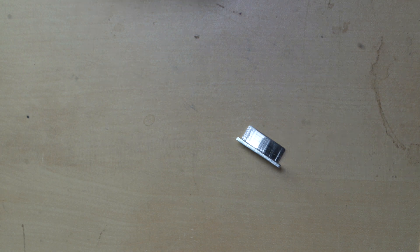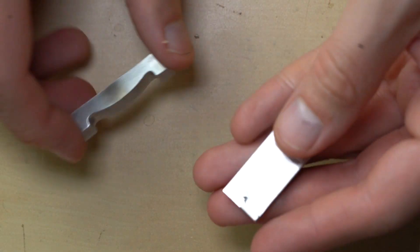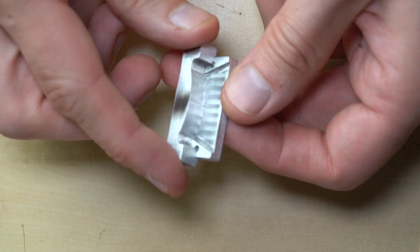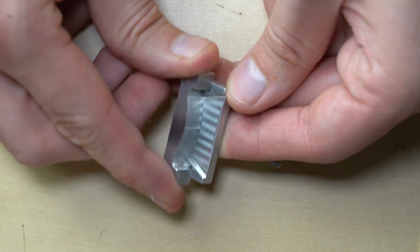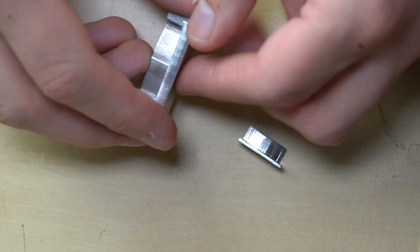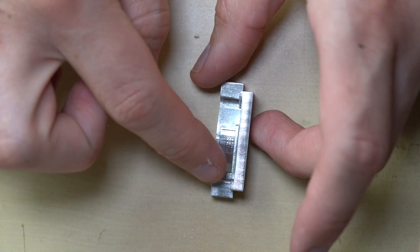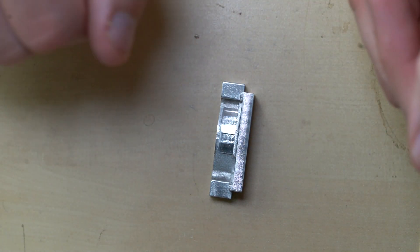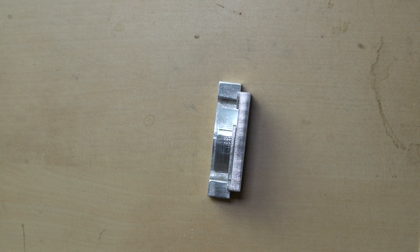Then we have our other holder that comes in two parts, with a really nice machining pattern. The real beauty of this part is just how well they go together - they slide into position with no effort whatsoever, but when in position they are just rock-solid with no movement whatsoever. The tolerances on here are just perfect, really nice. The part will sit in like this, slide to one side to drill the hole, slide to the other side to drill the other hole, then change to the countersink bit, countersink both holes, and we are basically done. Let's go over to the mill and just do that.